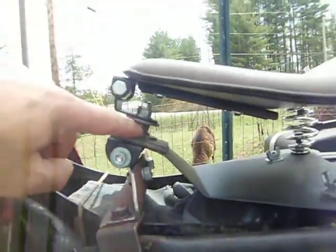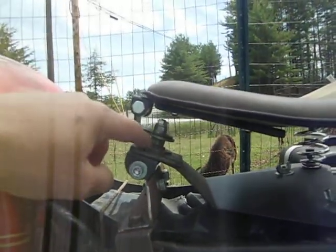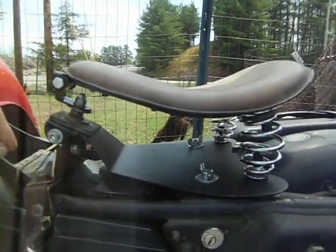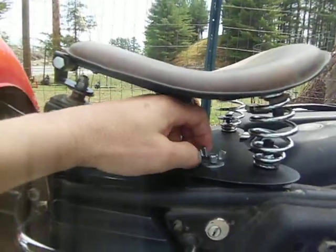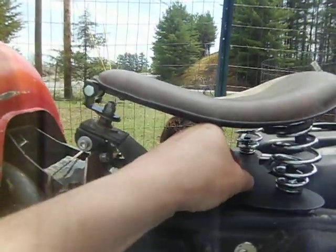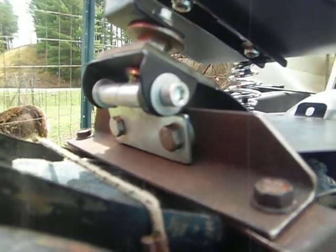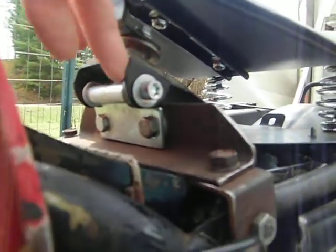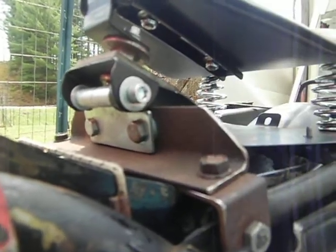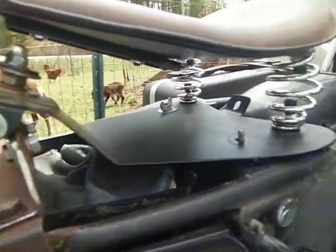For more reinforcement I also needed to jack it up a little bit, so I used a flange nut and a couple of washers because it had a large bore in that big washer. This is nice because you can gain access to the tool kit down in there and this pivots up. I used half of a regular hinge — bought it at Tractor Supply and pounded the pressed-in hinge pins out — and it fit just perfectly. A little spacer adjustment and a few washers to get it far enough forward.